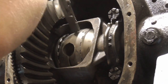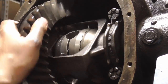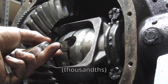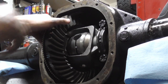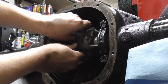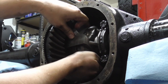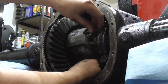I think I've got it all lined up now. Start pulling these pins. The gap is in between 145 and 170 — I can't get 176 in there, so I think we're okay. Now I've got to get this lined up. New center pin. New bolt with red Loctite already on it.